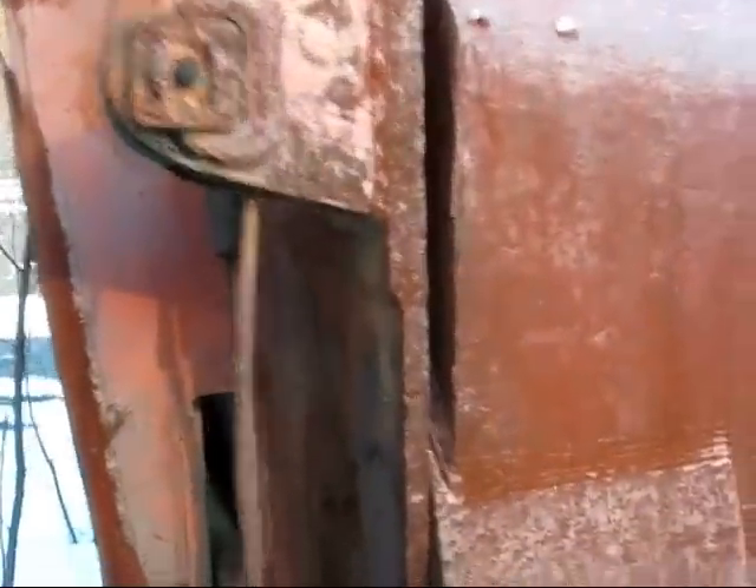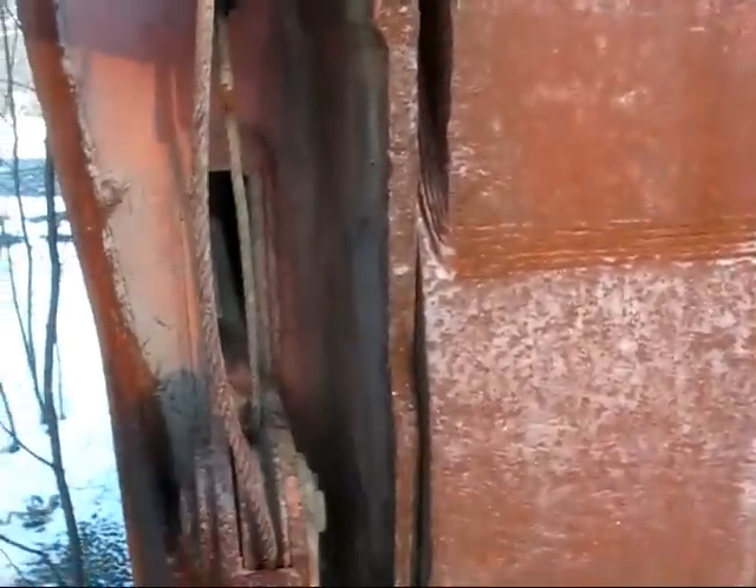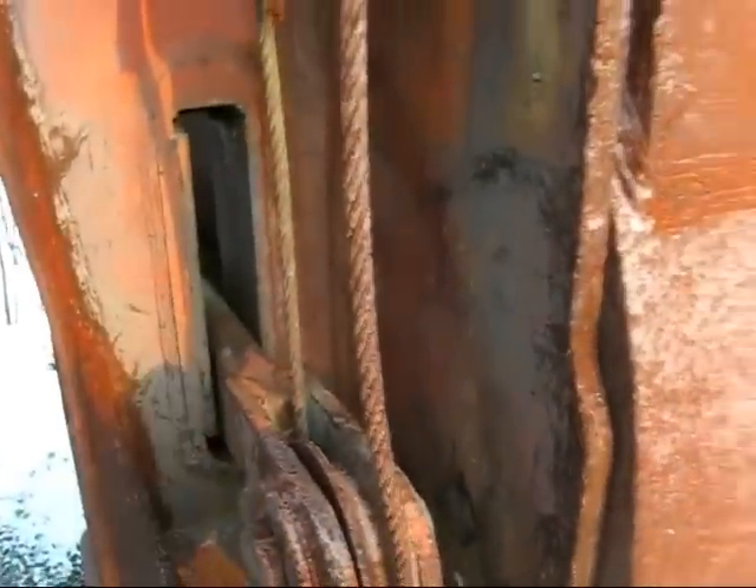Now, keep in mind, there are no hydraulics on this machine. So when the operator wants to close the lip on the bucket, he has to swing the dipper handle down so that the lip will hit the back of the bucket, the lock will be engaged, and the lip will be latched to the back of the bucket so the machine can resume digging.